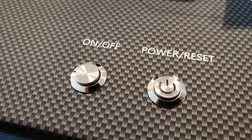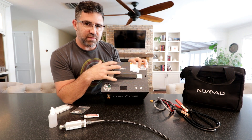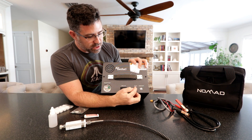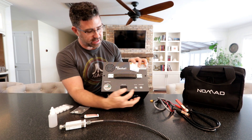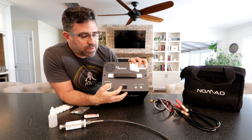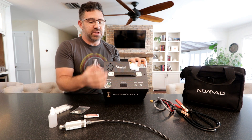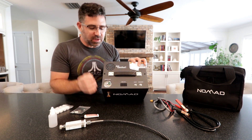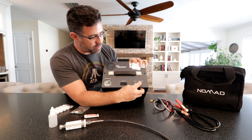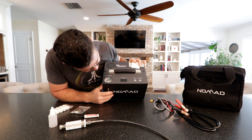Over here are your on-off switches. The first one I think of as a master — when you hit it, you'll hear the cooling fan for the inverter/converter start running. Then when you hit the second switch — which requires the first to be on — the compressor starts running. Now a quick note: there's a safety built into this unit where if you're filling your air gun and you turn off the compressor mid-fill and try to turn it back on, it's not going to work unless you first purge the air from the system and go through the power on/off reset, then start again.